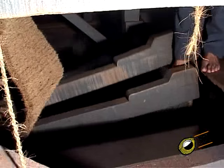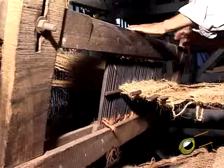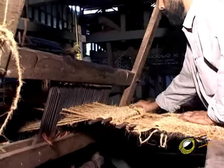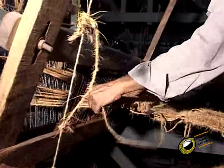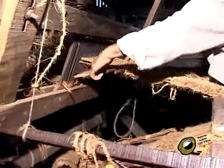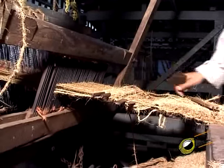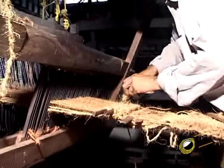To start weaving, depress the second and third treadles so all the slack warp threads are raised up. Insert a grooved iron rod through the shed and beat with the slay. Then depress the first treadle and insert a weft. After proper beating, the first and second treadles are depressed followed by insertion of another weft; by this process the iron rod first inserted is properly held in the mat with slack yarn bent over it. To insert the second iron rod, depress the second and third treadles again, insert the rod, then depress the first treadle to pass a weft yarn through the shed. Finally, depress the first and third treadles, insert one more weft, then pass a knife through the groove of the first iron rod to cut the slack yarn bent over it. Repeat the process for further weaving.